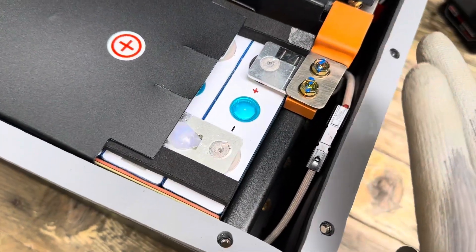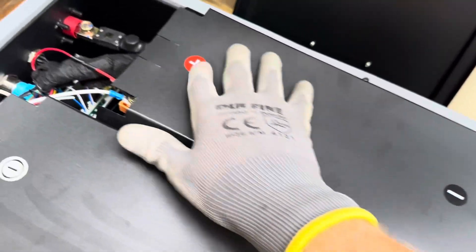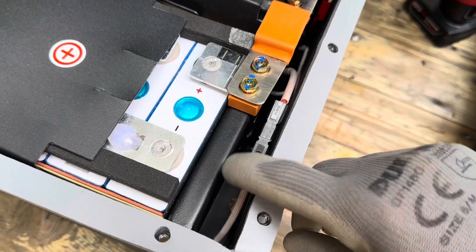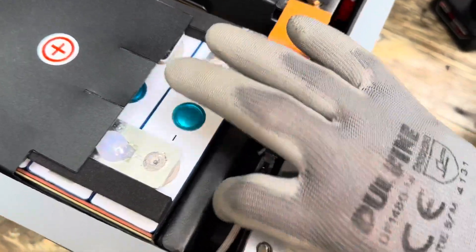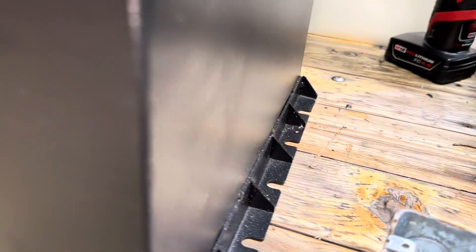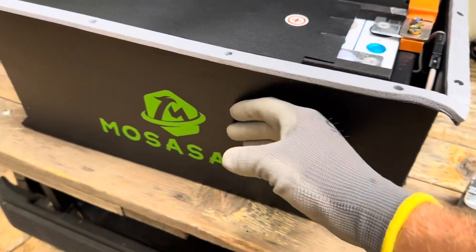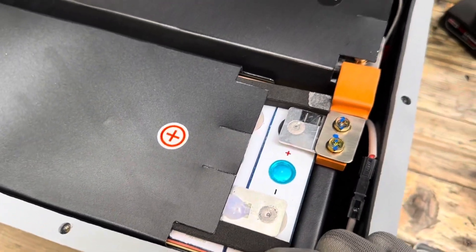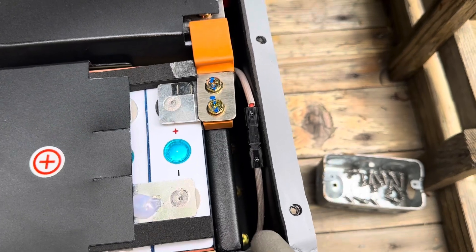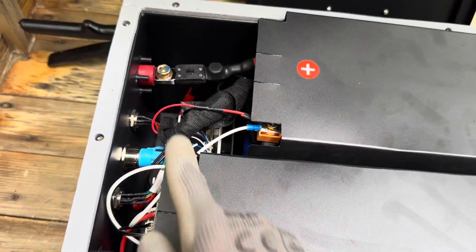A good pause about this battery — I'm liking what I'm seeing so far, and I'm not even pulling the covers off yet. Looks like we got eight cells here. Our series continues over here to the other eight cells because it's a 16-cell pack. They've got metal compression around the cells to keep them in compression. And look, there's a gap around the sides of the case right there. This hit on the side actually dented the case right there too. I'm glad FedEx dropped it on this side instead of the other side — there's not as much spacing there. I was expecting to see just foam here. That is refreshing to see a nice metal compression case, and it's bolted down to the external case. Got a fuse link on the end on the positive side.